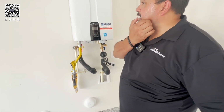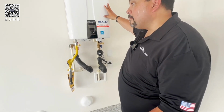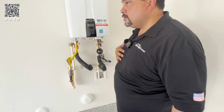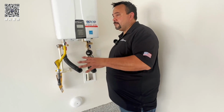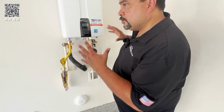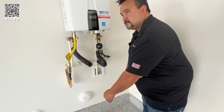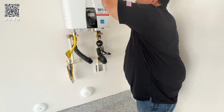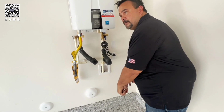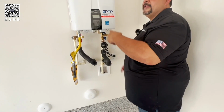So one time a year, they recommend you clean it. Can I clean it by myself? You can, or you can hire a plumber. What I recommend, call the plumber, pay for the first time. It's like $150 to $175, I believe. Pay for it, watch how they do it. It's pretty easy. 5-gallon bucket, 2 hoses, and a little pump. They pump the vinegar in, it goes through, comes out into the same bucket, and it recirculates the vinegar for 30 minutes. And then it's clean.